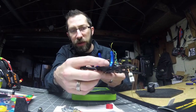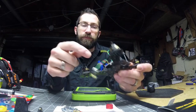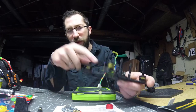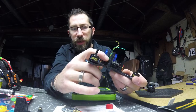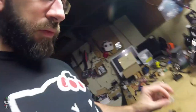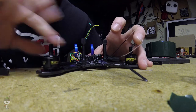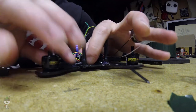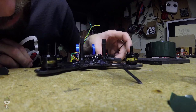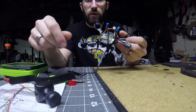So I've rubber painted all the ESC joints on the outside, as well as put vibration dampening in here. We just got the firmware flashed for this guy. Got the receiver bound up. This receiver is teeny. I've just kind of compacted these wires back there, so you don't really see much of anything. I do have the antennas now mounted, and heat shrink there.